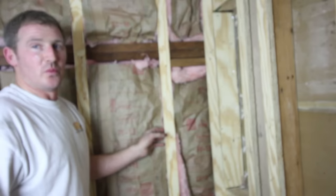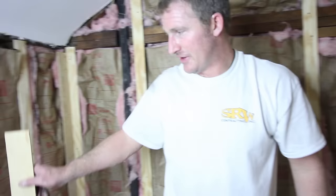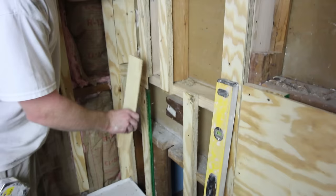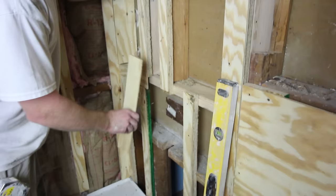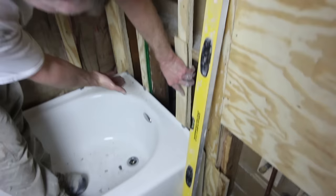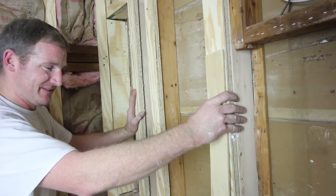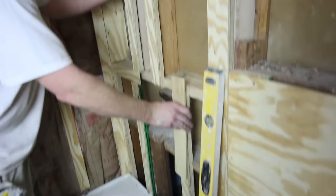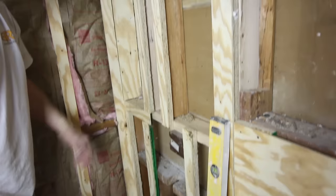Whenever it's possible to shim out so that the backer board goes straight to the tub, I'd say definitely do it. This is an exterior wall to the back of the tub, so building it out is not going to be any big deal. This side we were able to shim on properly because the plaster is thicker than the backer board. On this wall, we can either put another layer of quarter-inch over all the studs, or just do the backer board to the top of the tub flange and then fill that gap. At this point, I'm thinking we'll do the latter — partly because I'm running out of plywood, and also because it's already a small bathroom.